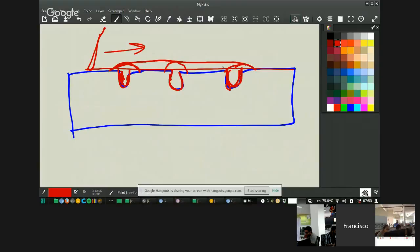So yes, you are halfway done now. The only thing you need to do is mix the silicone, brush the surface, and then pour, and then swipe this with whatever tool you need, like any flat tool. Swipe it, like remove this.